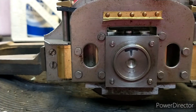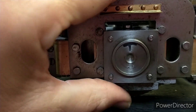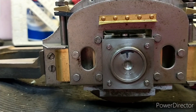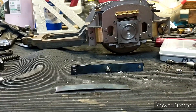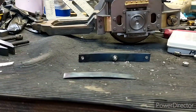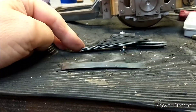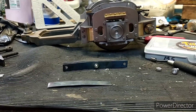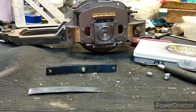It's very difficult to tune springs until we know how much weight is actually going to be on them. But we do have suspension there - there is some movement and we are supporting the axle boxes, so for now that's good enough. We'll probably come back to this as part of the shakedown when the loco is complete. If I make more springs I'll put a bit more curvature on them because there's not much compliance before they're flat. I think shaping the spring to that traditional elliptical shape would help - they did have a slight curve from where they were on the roll but I haven't deliberately put any more curve into them. Anyway, I'm quite pleased with that - that's my first attempt at making a leaf spring. I hope you found it interesting.